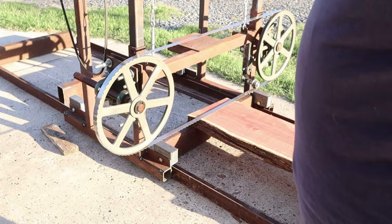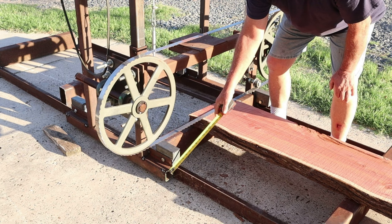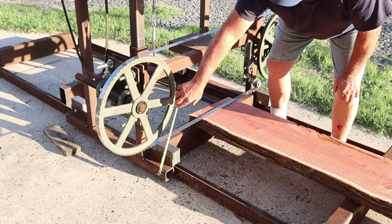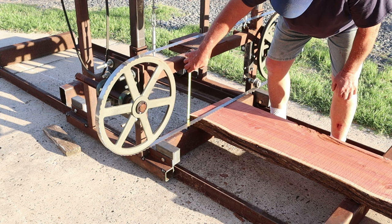That way we'll make sure you see what we're talking about. All right, let me try to explain that again. Sorry for the delays there, guys. We put our bunks here. We put our boxes like this you see right here above this 2x2 square tubing so that the carriage, the frame itself, would be dropped down alongside the 2x3 square of the angle. Now if you see here, we've got 2 3/16 from the bunk to the blade.